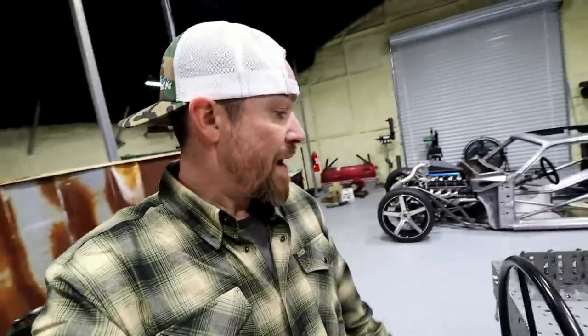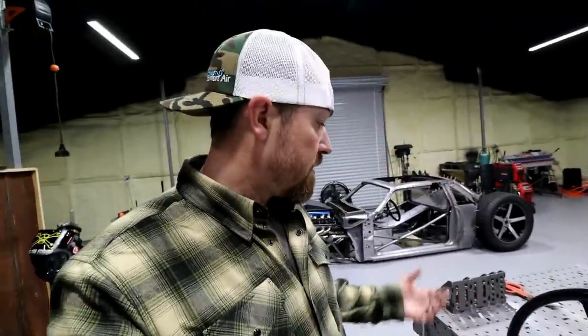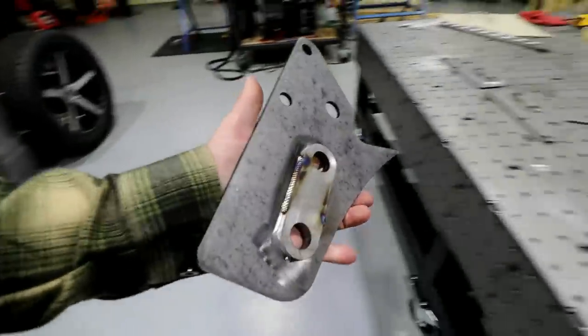With these Swag Off-Road wings, it's going to basically extend those waste pieces out. And remember, as you roll this thing, you're going to have a waste piece on either side. So if you got 6 inches on this side, you're going to have 6 inches on that side, because you can only roll it so far. You put these on there, now you've extended it to 10 or 12 inches of waste on either end. And that is if you don't need it to be bent. The piece I did on the Bibster, I actually needed about a 3 or 4 inch straight piece, so it worked out for me. All right, so that kind of explains the wings.